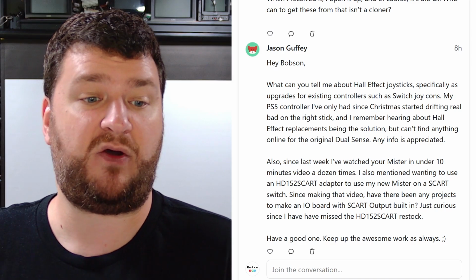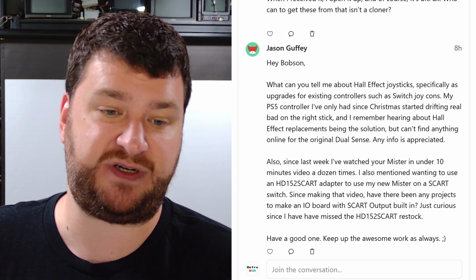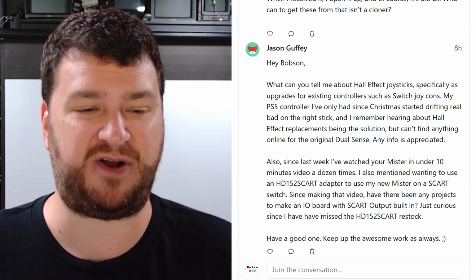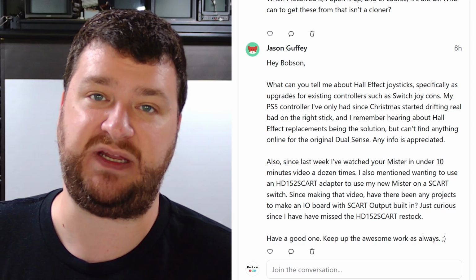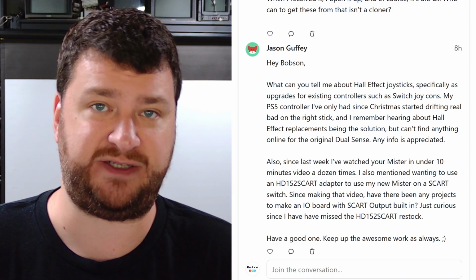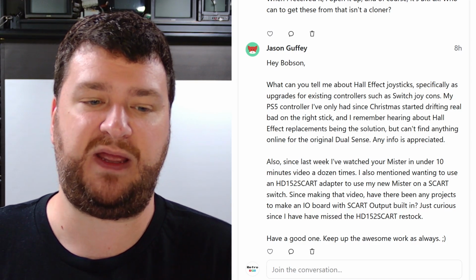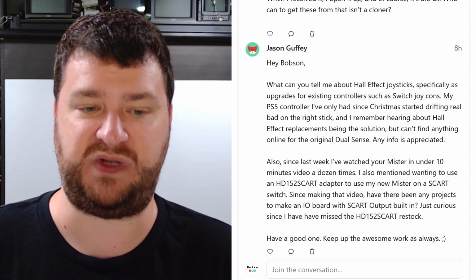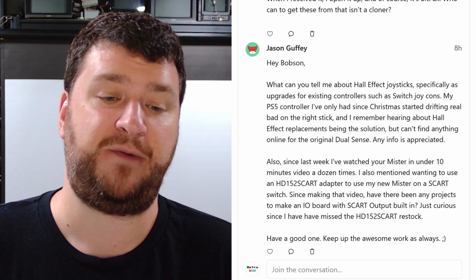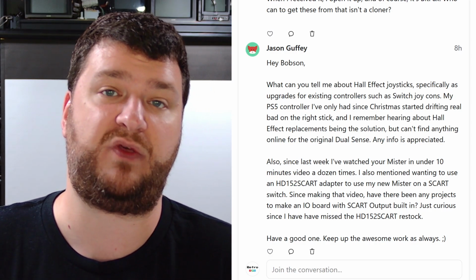And also, Jason was recently trying to get back into MiSTer stuff to purchase their first MiSTer, and they realized that even though last week I talked about the HD15 to SCART, those things ended up selling out immediately. Ryan switched it to pre-orders. The next batch should be here fairly quickly, certainly not like a year delay like the part shortage-esque stuff that's been happening with that. But if you need a solution right now for the D-sub to SCART adapter for use with the MiSTer or the analog DAC, you could very easily just get a D-sub VGA style to SCART cable with the correct resistor in it.